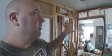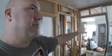And I'm not too concerned about getting all the drywall on the inside of this closet if I have containment there. But the idea is I have everything except for, and granted, when I say all the drywall in here, I'm not talking about over the block wall necessarily right now. But I want to get it over this area here so that I can put some plastic up there. And when I'm chipping, grinding, whatever, all the dust and everything will be contained to this room instead of being, you know, forced all throughout the house.